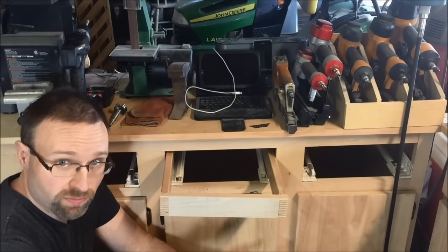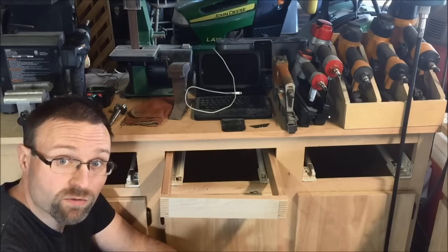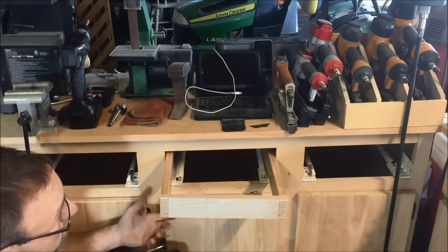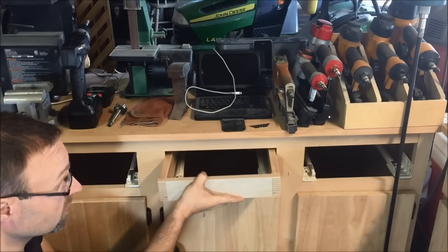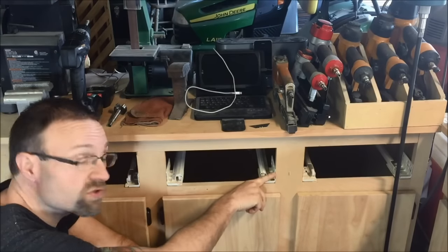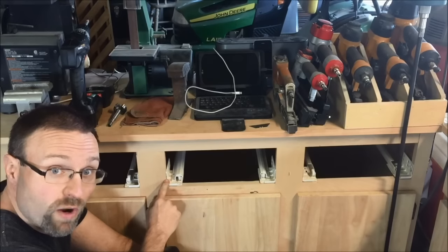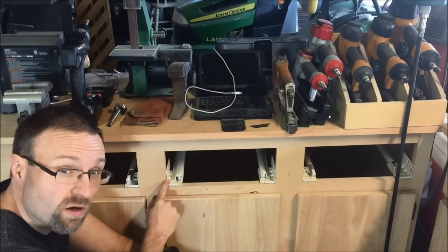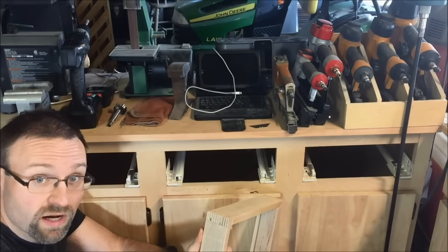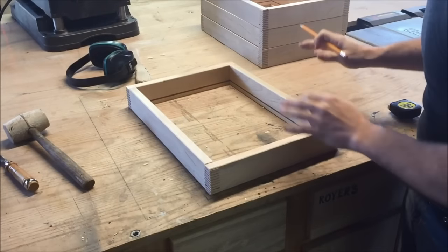One thing that's important when building drawers, especially with box joints and true fit work, is to stop every once in a while and make sure your measurements are correct. Well, lo and behold, I've made a mistake. The drawer fits in the slot just fine, but I didn't accommodate for the sixteenth of an inch or 3/32nds on both sides for the actual drawer slide. So I have to come up with a creative fix — I'm going to take off a blade's width on the lower half at the table saw. Measure twice, cut once.